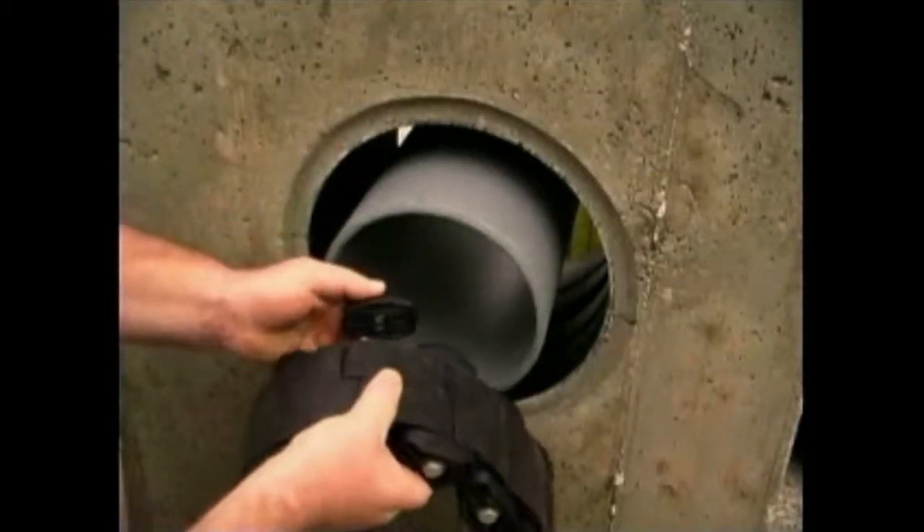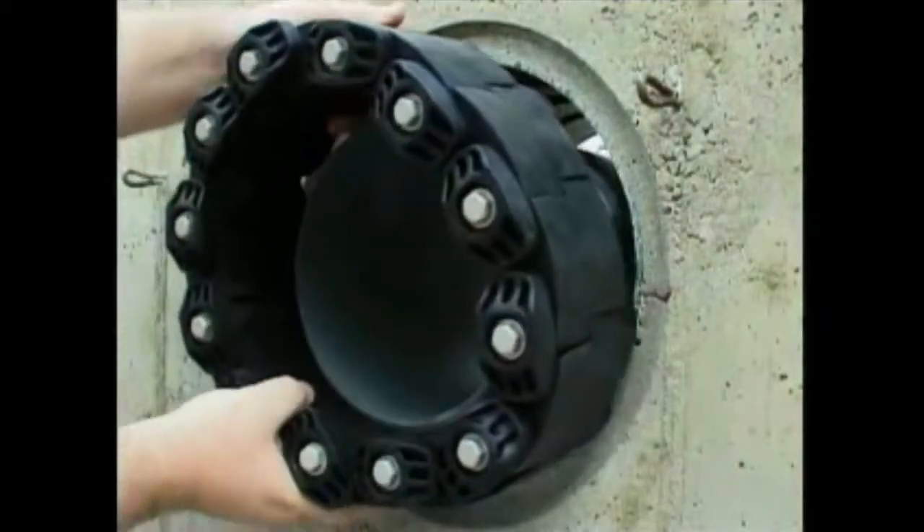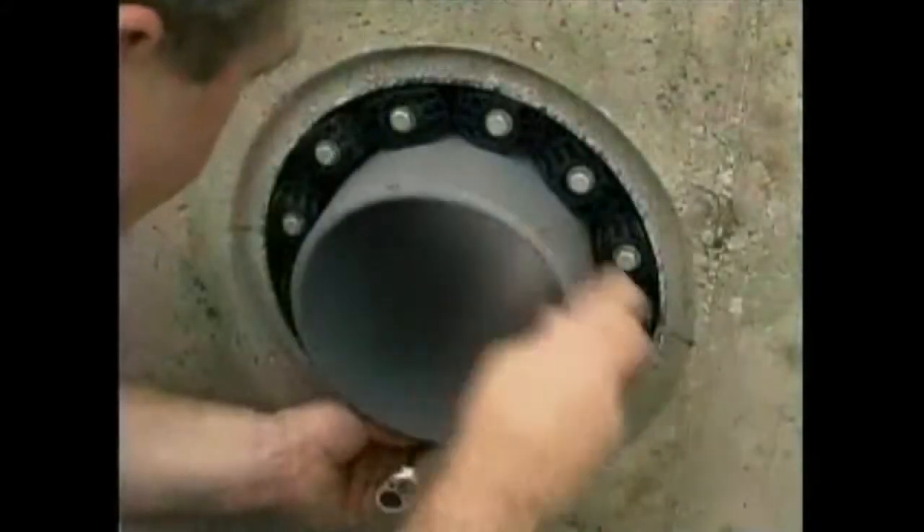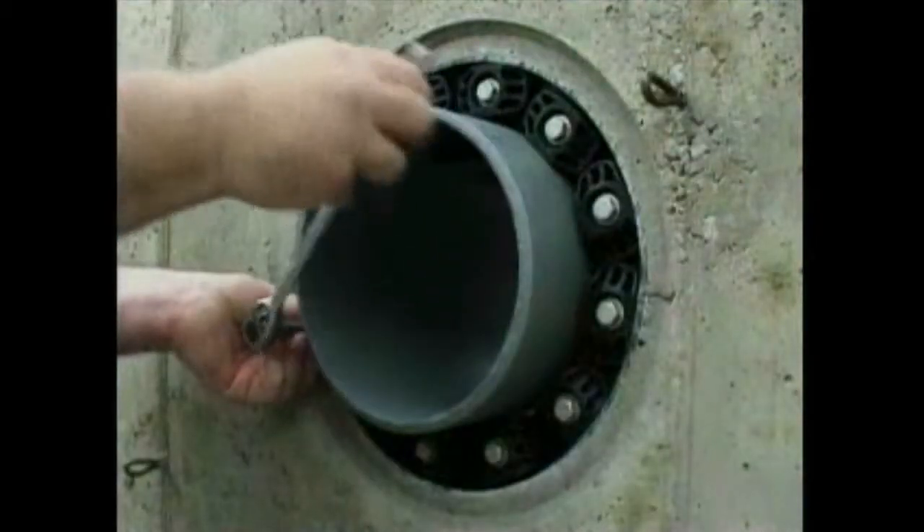The first and last links are connected and the belt is wrapped around the pipe. Sometimes the installer may notice extra slack in the belt — it may appear as though there are too many links for the installation. Tightening or preloading the belt will eventually remove this slack to allow easy belt insertion. The belt is positioned in the annular space between the pipe and wall. Some angular misalignment and eccentricity may be allowed; pipes slightly off-center or installations where axial misalignment exists between pipe and wall are sealed even though they are not perfectly centered. The installer begins the tightening sequence at 12 o'clock and proceeds clockwise, tightening each bolt two or three turns at each pass.